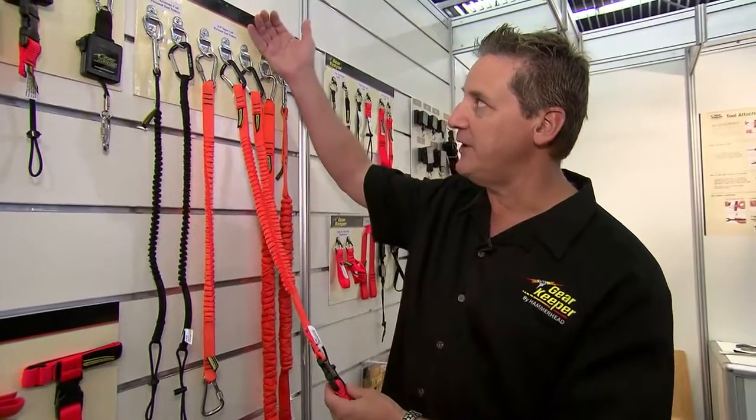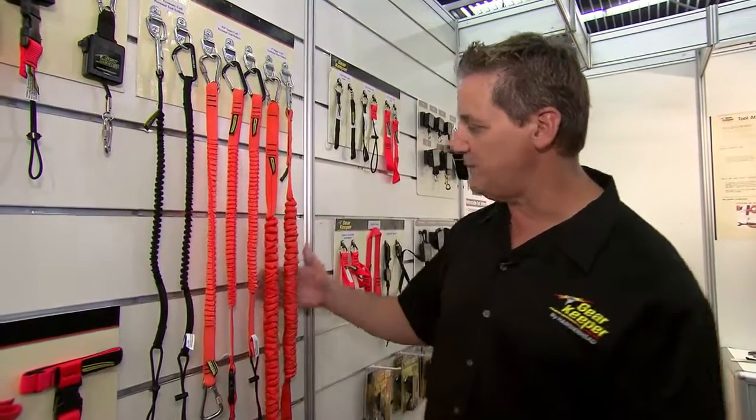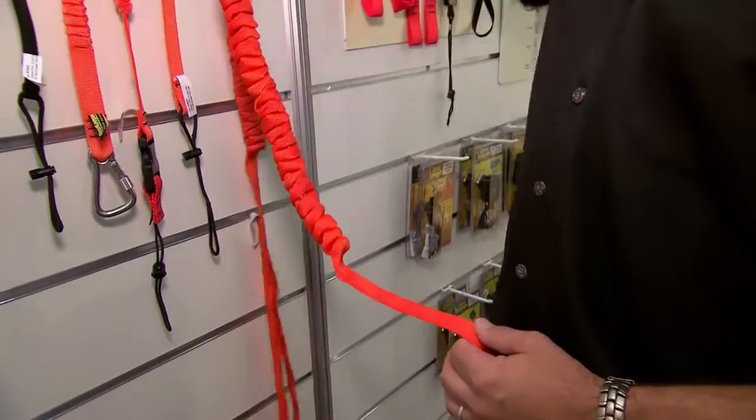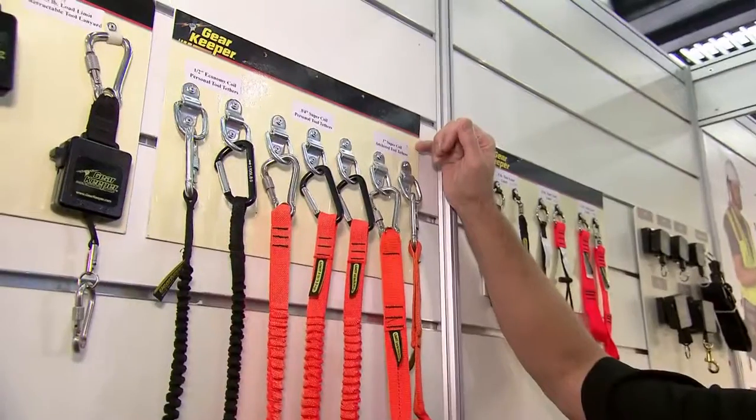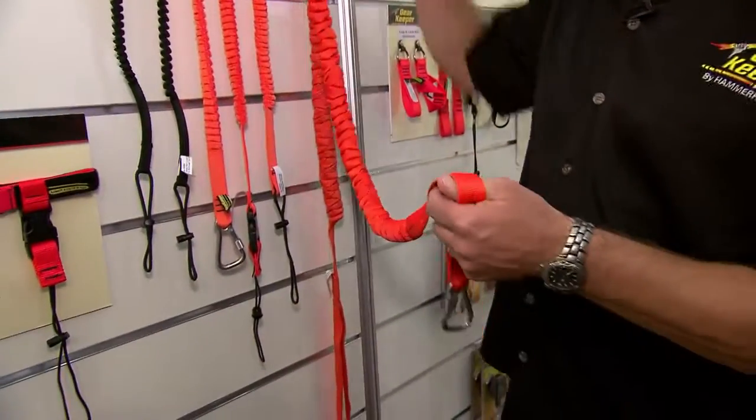There is no standard that tells people how much weight to attach to a person. These are made for up to 6.8 kilograms, based on US customer requests, though no standard defined how to test it. Really in the 4 to 5 kilogram range, you want to seriously consider whether you're attaching that tool to yourself because of the shock load when you drop a tool. That's why we build anchor tethers like this — rated up to 11.3 kilograms with about 300% stretch, so you can stretch to almost 2.7 meters while anchored to a structure instead of yourself, not endangering the worker.